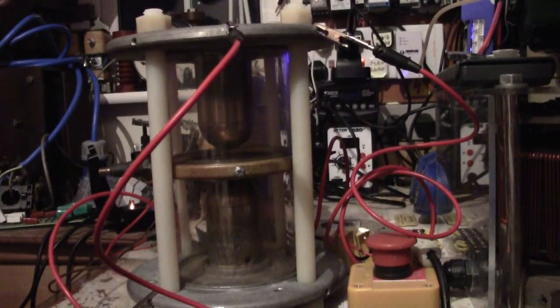So I bought something really cool that I really like, and it's actually going to have a very good use — hopefully. It might not go to plan, but with any luck it will. I'm going to get my Tesla coil up and running. Instead of being 40kV, I will run it at 20kV and double the amperage because this spark gap can take it. That just means running the transformers in a different configuration — not sticking 200 volts in to have 40kV. I can even run them centre-tapped or in parallel.